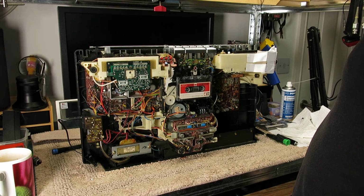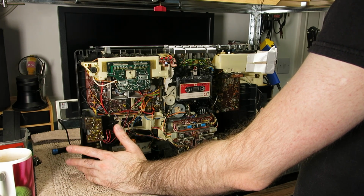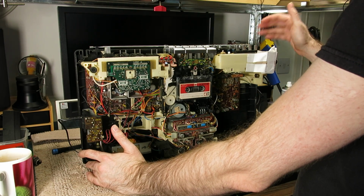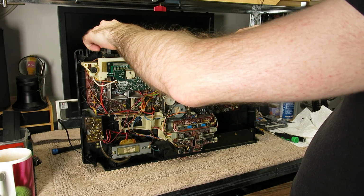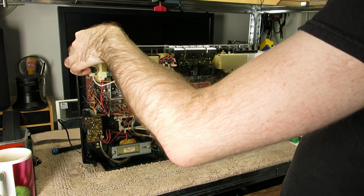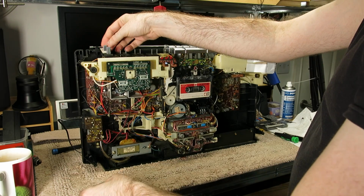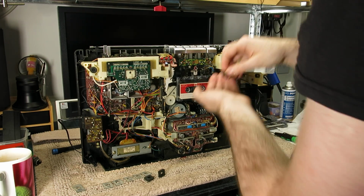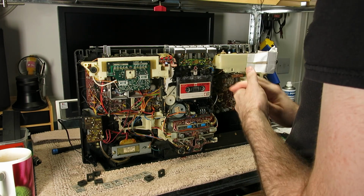I've got my video lights out again these winter days, I don't know. So I spent quite a bit of time last night going over this and checking all functions and seeing what does and doesn't work, and it all mostly does work. Some of the switches want cleaning, so I've removed the top panel. It's not actually too bad to get this top panel out. You just ease it forwards and then it will lift off, and all these switches have got these little escutcheon things around them that I'm going to take all of those off and clean them all. If you've seen any of my previous videos, you'll know that I've taken apart stuff that was in much worse shape. This is incredible really, but yeah, just want to fettle up.